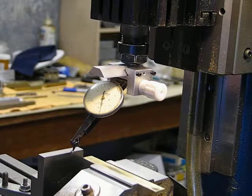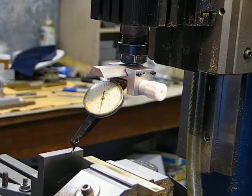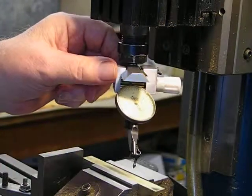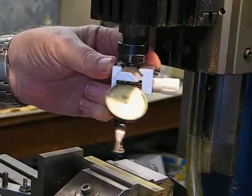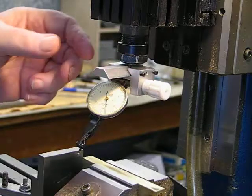In this case I'm going to try and find the center of this brass bar — a half-inch bar in the vise — so I can find the exact center. Normally I'd use a wobbler of some kind; I don't have any electronic gear, so if it's not too important I'll use a wobbler. But I built this because I've seen something similar on the market and it's so big — it's built for Bridgeports and mills of that size — that it just doesn't work very well on a Taig machine.